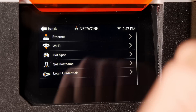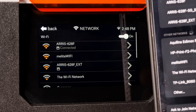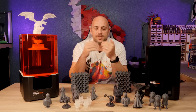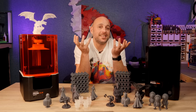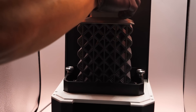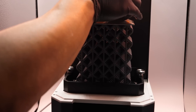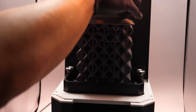Another thing is the Wi-Fi. While the machine has Wi-Fi, which is absolutely great, I would also appreciate if it could accept 5 GHz frequency, as some files tend to be quite large and take forever to transfer over Wi-Fi — unless you are connected via Ethernet, then it's just instant. Another interesting quirk I came across is that if you have to print something that is full build volume, like these lattices here, getting it out of the machine is going to be an adventure in itself. The build plate sits right at the top so it can't move any further, and the VAT is in the way. Therefore you can't really take the print out without having to unscrew the VAT and then do a coordinated dance between sliding both the VAT and the build plate together to avoid drips.